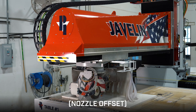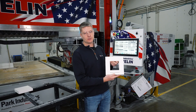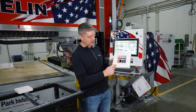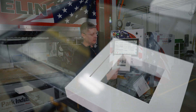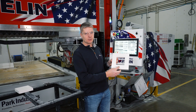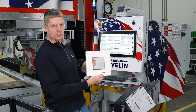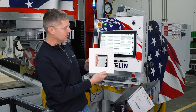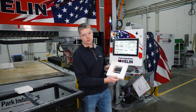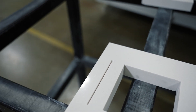We now have our part for the nozzle offset calculator. Something unique to this part is the cut line made by the waterjet. This serves a couple of purposes: first, so we have it oriented correctly — the image on screen matches what you'll see with your parts. It also gives you a spot to measure the thickness of your waterjet kerf.